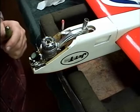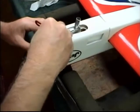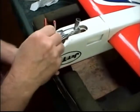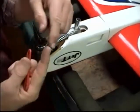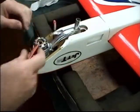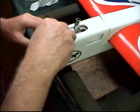This part of that I don't understand yet. Thing a lot of people don't really understand, and when it was explained to me in engineering terms, I wasn't so sure I understood it, but when you add a layer, now we have the nut, the motor, and two sets of shims. Now we have more faces of things that can tend to loosen up. So we're going to have to monitor these bolts now, just in case, of course.